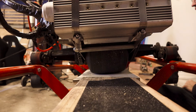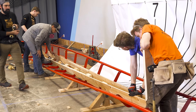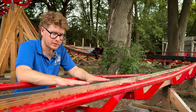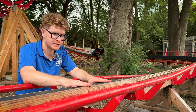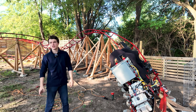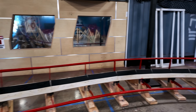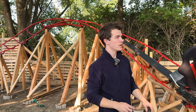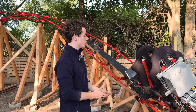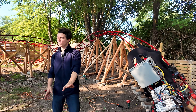In order for the coaster in a box ride vehicle to launch itself, it needs something to apply the wheel to — and that's this drive rail. Similar to our wooden trusses, this is made out of wood, which was a lot easier to do in the short time span we had. In our production model, this is actually made of steel but will also have grip tape on top for a little more friction. Mark Rober had a requirement that we had to go up over nine and a half feet tall so he could walk under it, but in a very short space — so we had to make the drive rail wrap around and go up over the top. Knowing we had to reach that height, we used kinetic energy calculations to determine how fast we had to accelerate, and those calculations defined how powerful our motors were, how many motors we use, what type of batteries we use, and what angle the bank turn is.